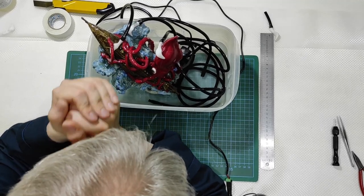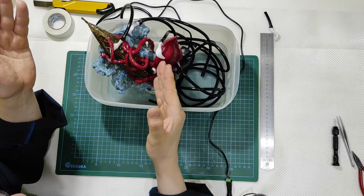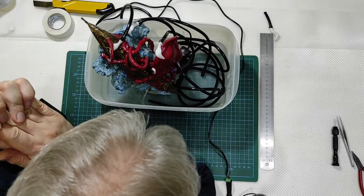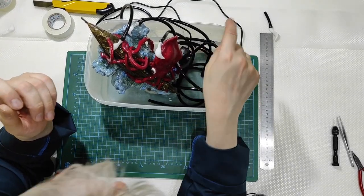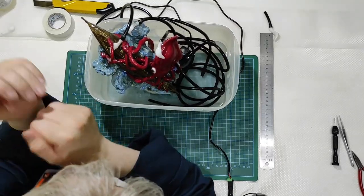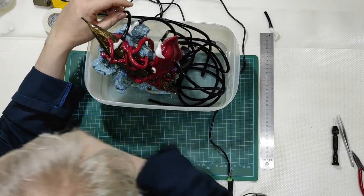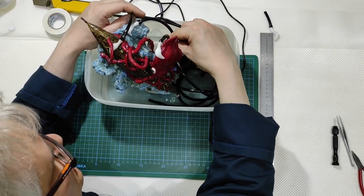The more the water has to travel, the less powerful it will be when it comes out of the tentacles. Simply physics, guys. The power source is very far from the tentacles. So I will try to reduce the length of those pipes, getting them as close as possible and curving them